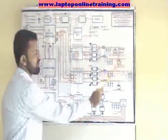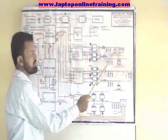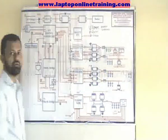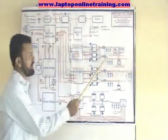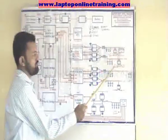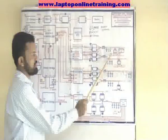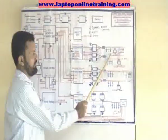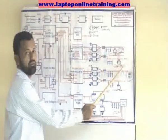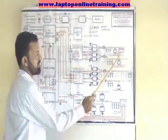From there, 3V PCU will always be on. From this 3V PCU, the main 3V and 5V will be output depending on the dual MOSFET. When we get the power main on, it will give the supply 3V, then 5V. When we press the power button, then the 5V and 3V will come on as main. Another is a suspend — means sustain — standby power. Either main or SUS power will be on.